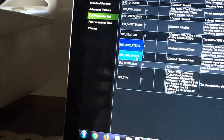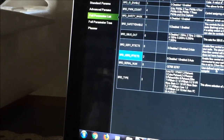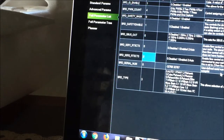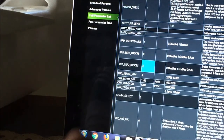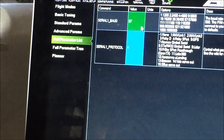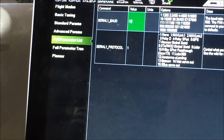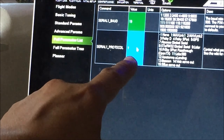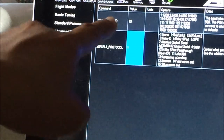Since you've changed the settings for serial port 1, you also need to change the protocol. By default the serial baud rate parameter is 57600. We need to change it to 19200, which is the baud rate of MAVLink on the receiver. The serial protocol should be 1. Again, write parameters. So we have 19200 baud and protocol 1.